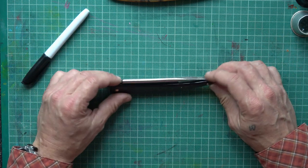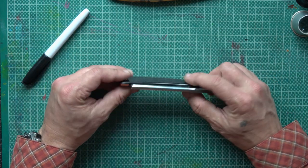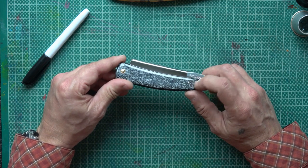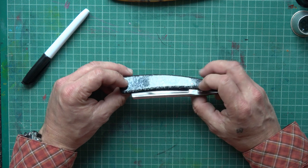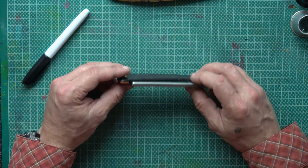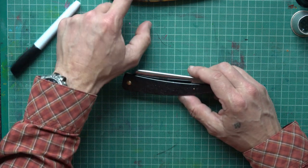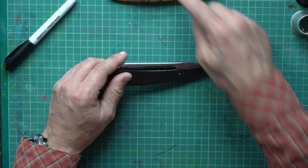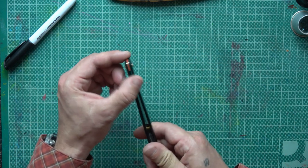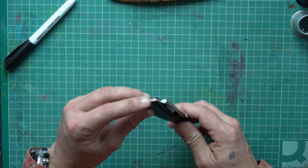I'm happy with how the razor turned out. I've got better at my pinning. I've got it a bit tighter without any sort of marred edges or anything. I did scuff the scales ever so slightly, so I've got to put some of this tape on it either side. I'm going to hole punch a little hole and then put the tape over it next time. So hopefully it might save me 20 minutes sanding.